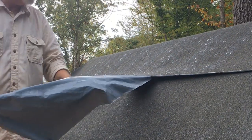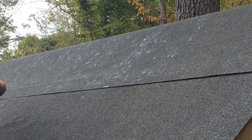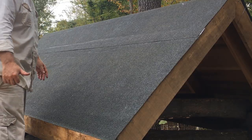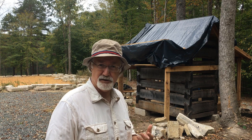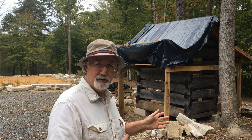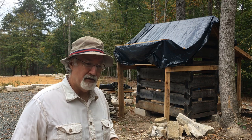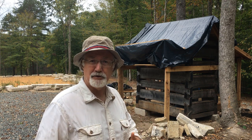What I'm going to put on this little log shed is slate roofing. In my opinion, you don't necessarily need a membrane underneath slate roofing, but I don't see where it can hurt. It's also a great medium to use during this period when you don't want your house covered in plastic but want it protected from rain. This is a part-time project for me — I've roughly figured out there are going to be about 750 slates that need to go on — so I can see this being a slow process, and I'd like to put down a membrane that will work well with slate and endure longer than tar paper, especially during this transition period.